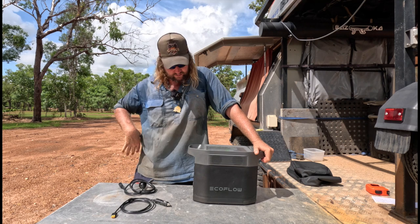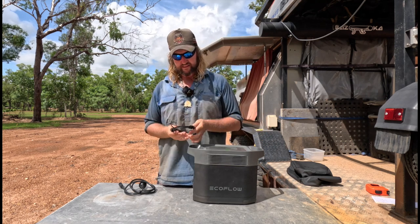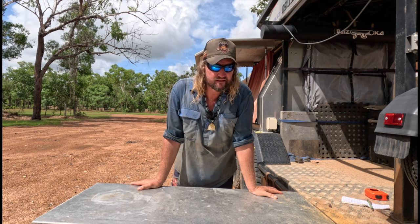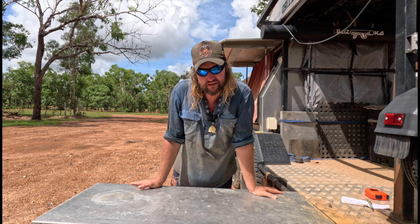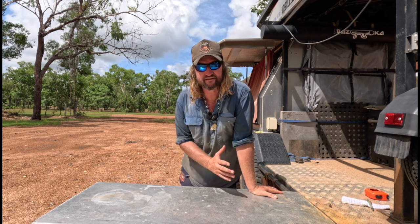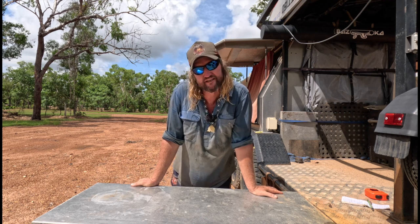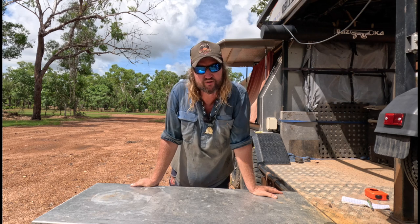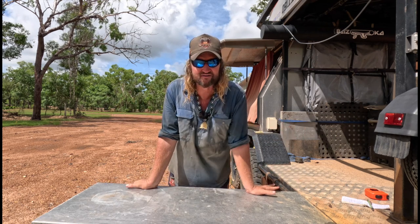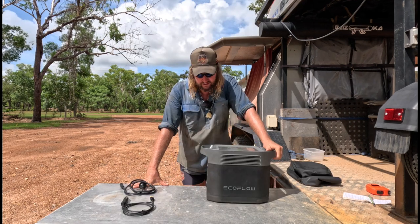The thin leads are a concern — it was fine with one 160-watt panel, but it'll be interesting with two panels running through the same lead. I'll also want an extension. Another con: it's only rated for 800 full cycles before it may drop to about 80% of its total watt-hour capacity. So after 800 cycles you might only have around 900–1000 watt-hours. It's not dead after 800 cycles, but it's something to keep in mind.